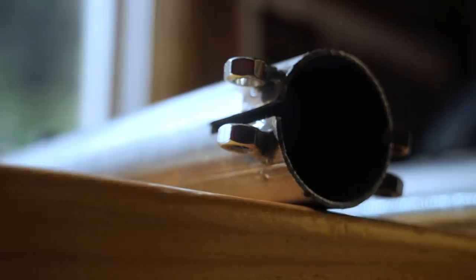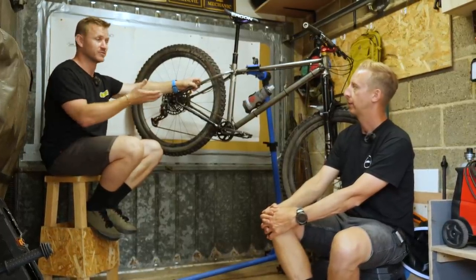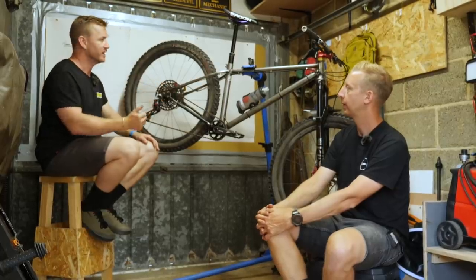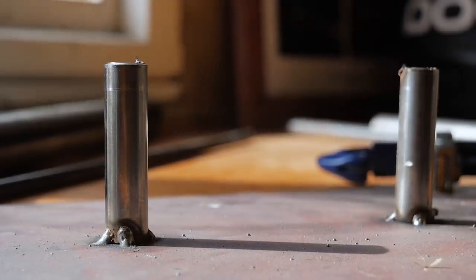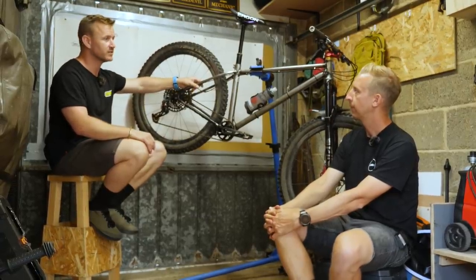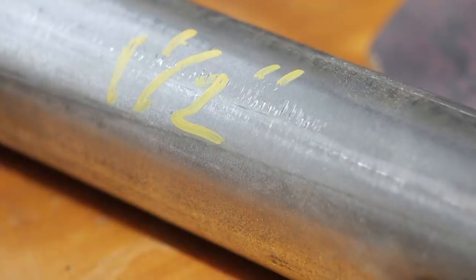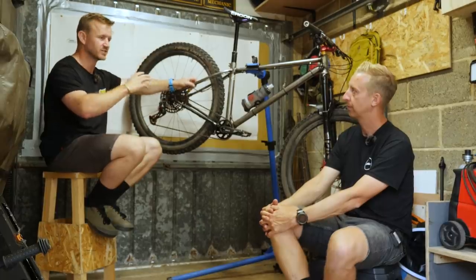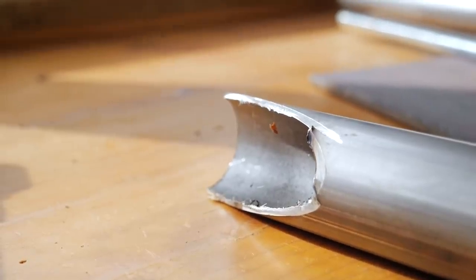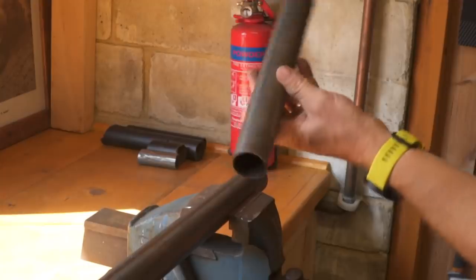What's it made from? This is mild steel. I did a bit of research before I started because you can go into a massive rabbit hole with the materials you need to make a bicycle. If you want to make a really nice lightweight bike — which this is not — you go for Reynolds tubing, titanium, or aluminium if you're good at welding alloy, which I'm not. So I spoke to Alec Steele on YouTube — he's a guy who makes stuff — and I asked him, I just reached out and said, dude, I just want to make a bike, what tube can I use? And he said just go down to your local merchant and get mild piping steel tubing with a seam in it. This has got a seam. And I went to Deviser Steel just down the road and I was like, I want this size, that size, this size, cut this much.